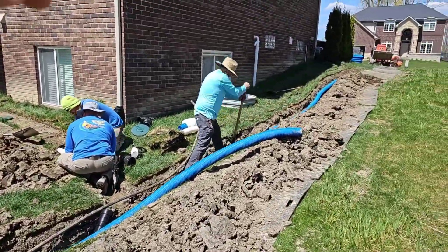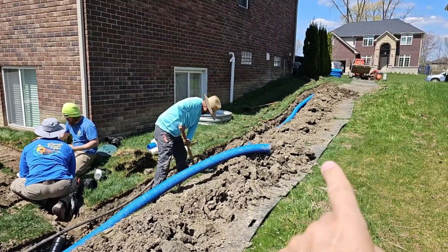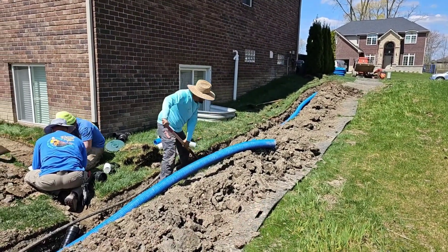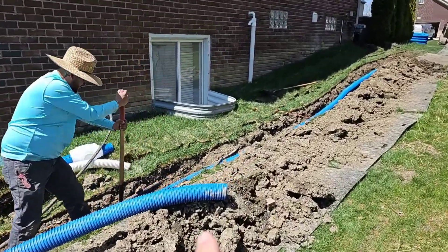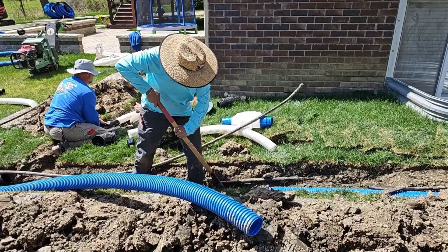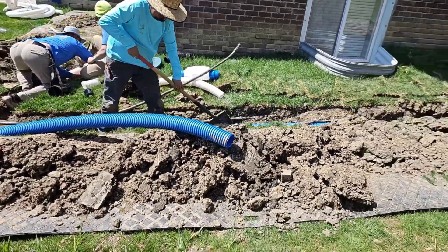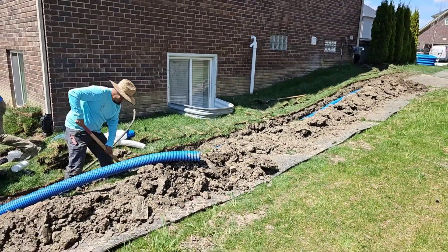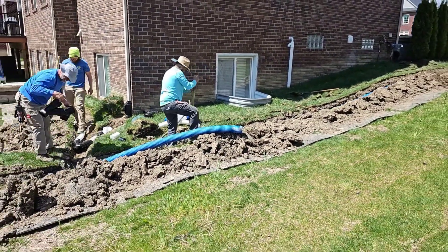So as a general rule, always, when your line changes from a really steep decline and then it's more subtle, put in a sediment trap — always. Because right here the water is going to decelerate and it's going to drop all the sediment that it's carrying. You want to put a sump where those two grade differences meet. This is perfect right here — this is textbook. Beautiful job the guys are doing.